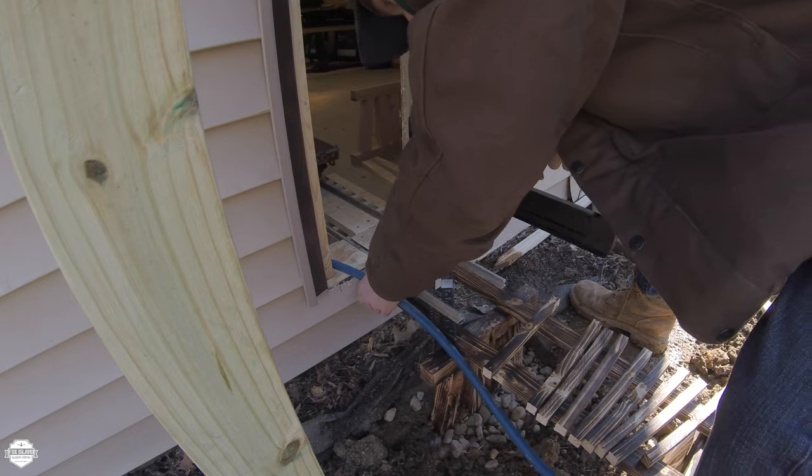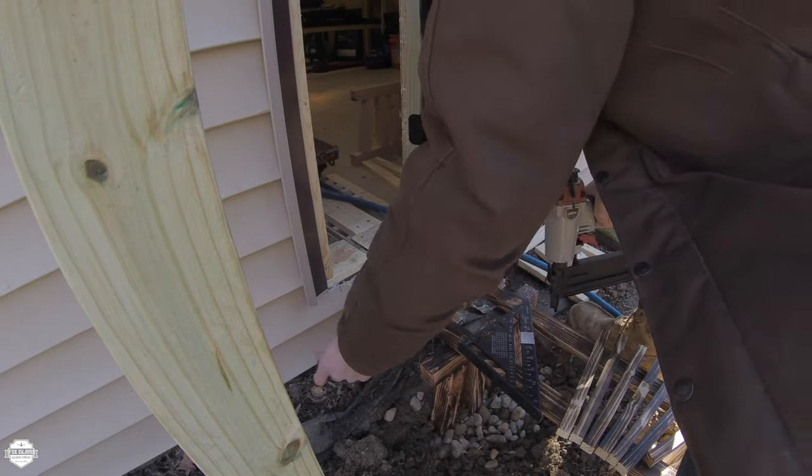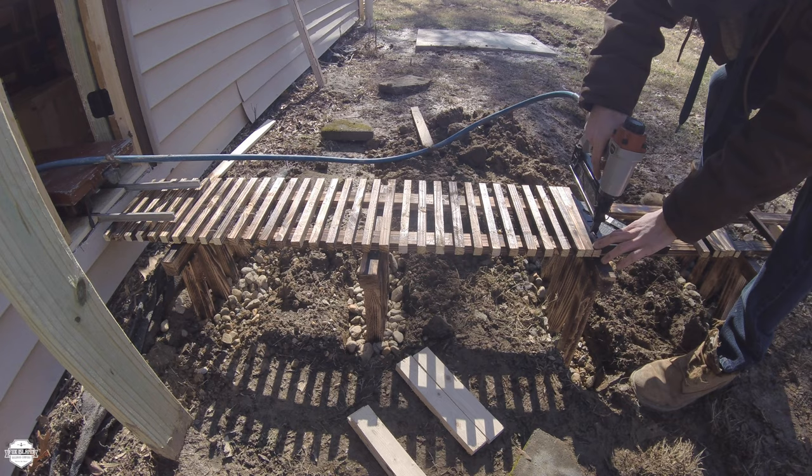The next step was anchoring the ties to the trusses. These ties are all cut to 3/4 inch square by 9 inches long and charred individually. This was also quite a tedious process, but well worth it for the true to scale look in my opinion.